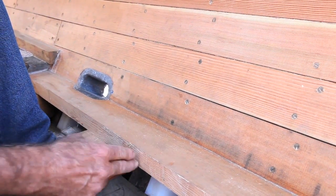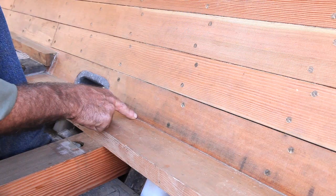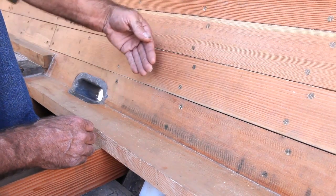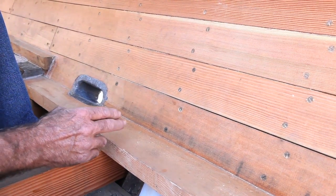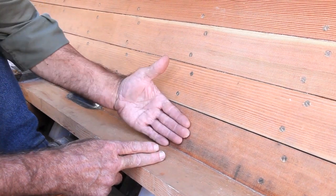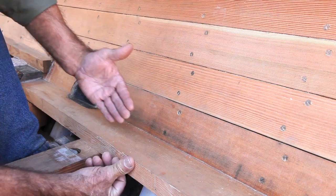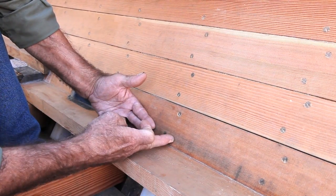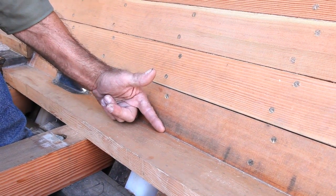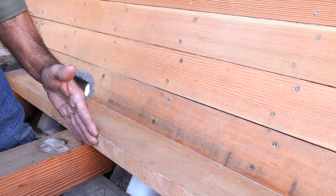The one place that's really broken tradition is this piece of ceiling right here, which was put in first. It's considerably wider because it extends down behind the first piece of deck — you might call this a covering board. Because this is a problem area in a lot of boats — it's a harder seam to caulk since it's on an odd angle — what I've done is progressive bevel-sawn this piece so that the angle on the outboard edge matches up to the plank perfectly. I patterned it, cut it to a progressive bevel, and slammed it up against that piece and glued it off. Now you have a seam here that will never need to be caulked again.